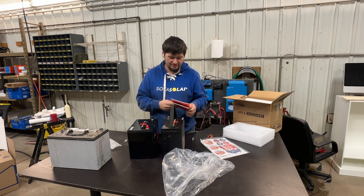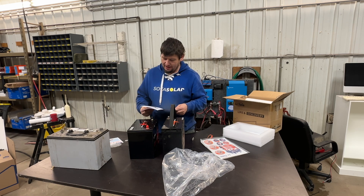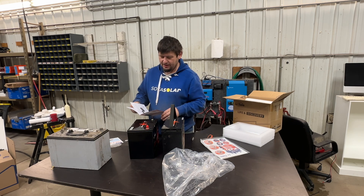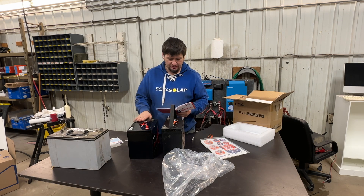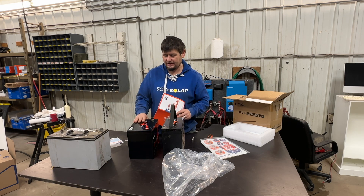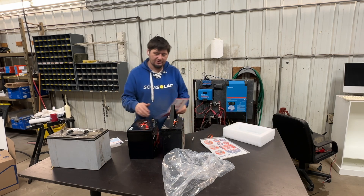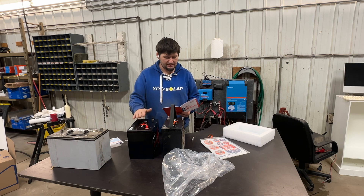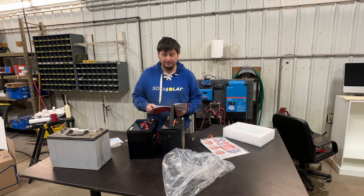They sent me this battery not that long ago. Something to keep in mind with these batteries is they're really only rated at about 20 amps charging current, so these batteries are really meant to be used in parallel with a couple of other ones. They'd be fine for a simple camper or maybe an ice house with DC-only draws, but once you start trying to run an inverter like the Victron Multi Plus, you probably want to be running at least three or four of these in parallel.